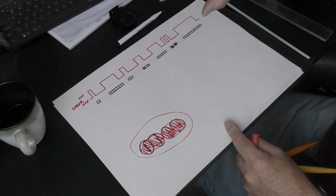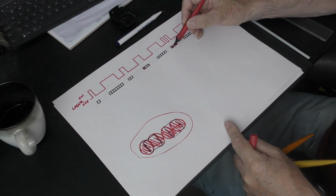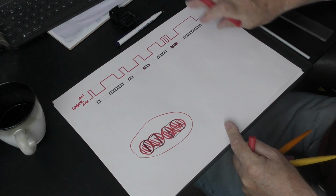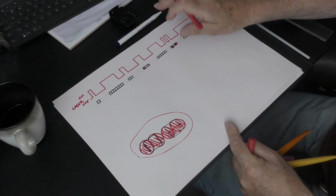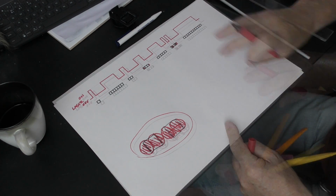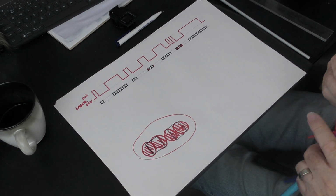We're exploiting the response time problem, which some would see as a problem, in a glass tube machine to make sure that we get nice clean pixels. And you do that by controlling the power. If you put too much power into photo engraving, you will finish up with this situation. We've got to balance the properties of the HV power supply with very low power to get this effect, single pixels. And this is the reason why I've never been able to get successful photo replication on an RF machine.